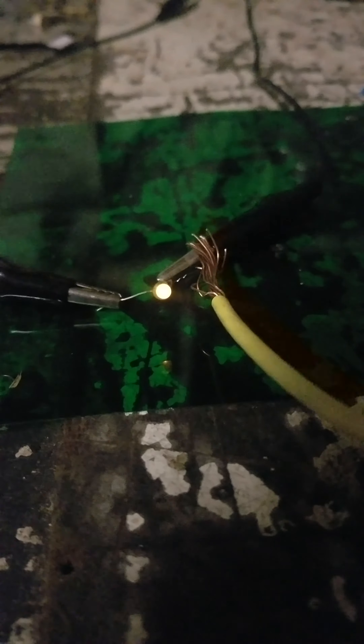Now I'm going to take the ground rod again to show you. Ground rod A is really bright — half is bright. Ground rod B — same effect: half is bright, full bright, half is bright. It's not really that bright, and the camera makes it look a lot brighter than it is. This is really loud. Let me take one of these clips off. You can see here's the LED by itself — it's not lit up. I touch that, it doesn't light up. If I touch the negative side, it does light up.